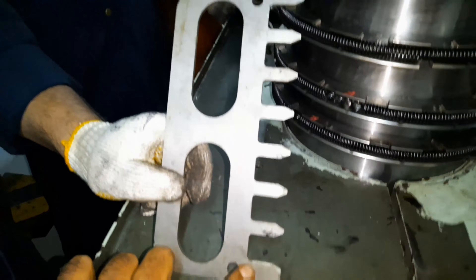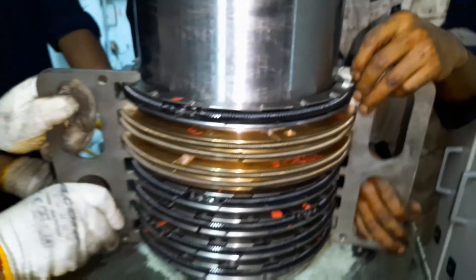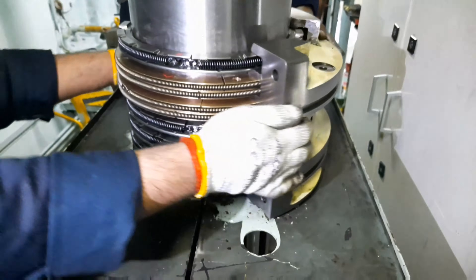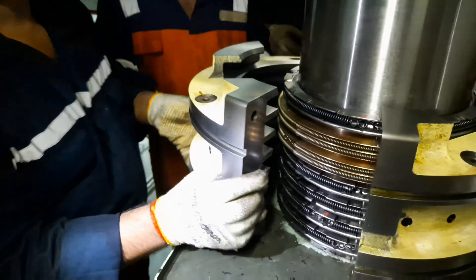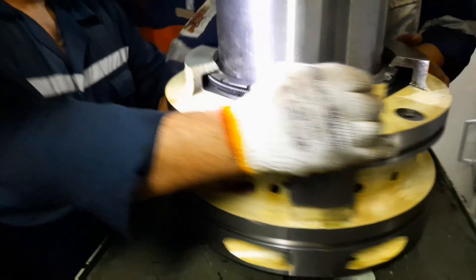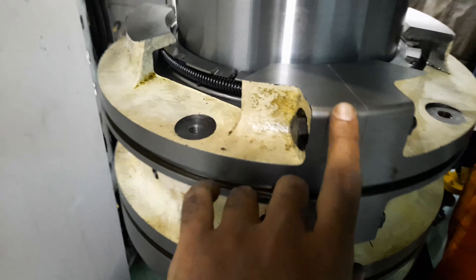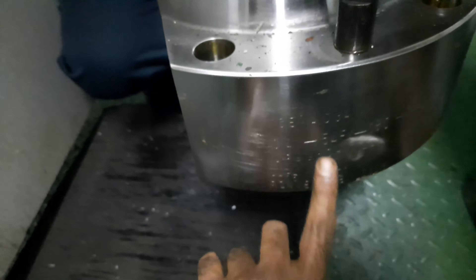During the overhaul of a stuffing box, it is good practice to examine the sealing and scraper ring end clearances. I have already uploaded a detailed video on my channel elaborating the step-by-step procedures to dismantle and assemble back the stuffing box on a piston rod — I would request you to watch it as it will give you a clear picture of the job. Always align the embossed numbers on the two halves of the stuffing box with its direction in line with the details embossed on the piston rod foot. This will help during the installation of the piston in the correct direction into the cylinder liner.